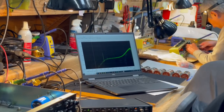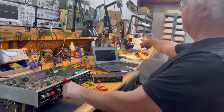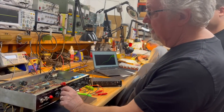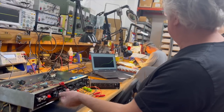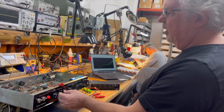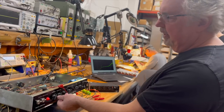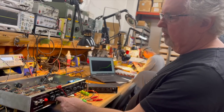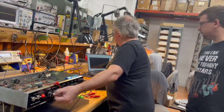It still brings that frequency range way up there above 10 kilohertz, but it's not as radical and it's not as controllable. You can see why David Reeves made the presence control attenuate below the 12 o'clock position at a different part of the circuit, because otherwise it would not get rid of this big rise.